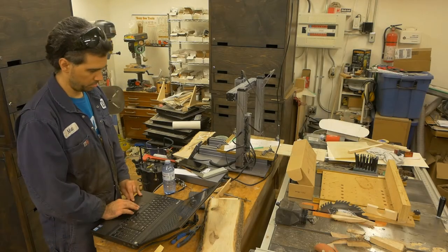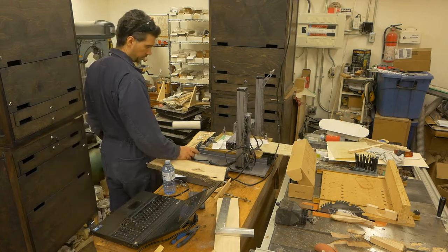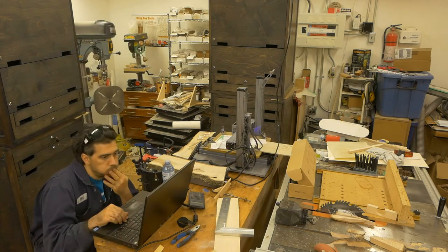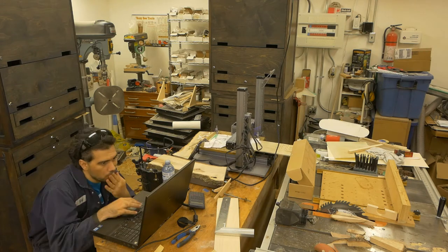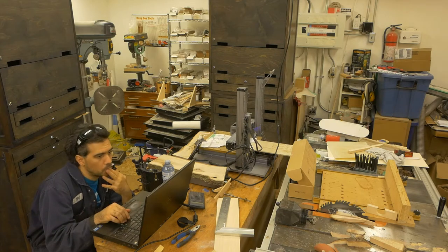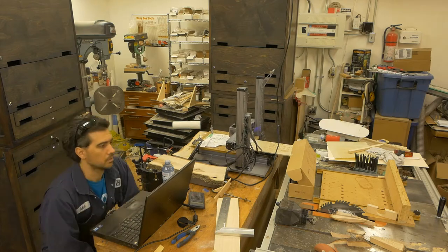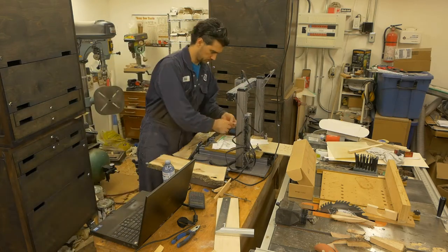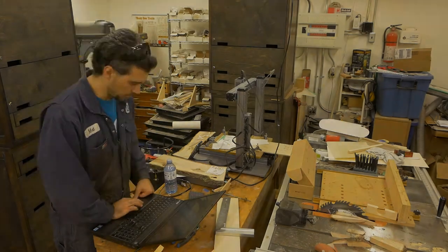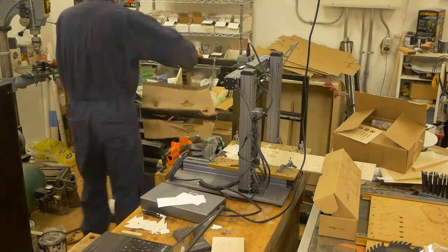Having those cutouts really showed how the layout is going to look. I know it added a bit of time to the project, but with such unique wood I didn't want to rush — going back to what I mentioned earlier: measuring more than twice and cutting once, or in my case CNCing once. When you design something on a computer you don't get the real feel of the live edge, because the wood has different colors, different grain variations, curves, knots, bark, and imperfections. With the different-sized cutouts I was able to select which size fit best and also align them so that they don't interfere with any of the other features.